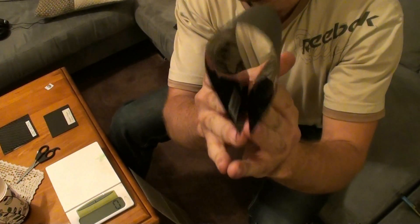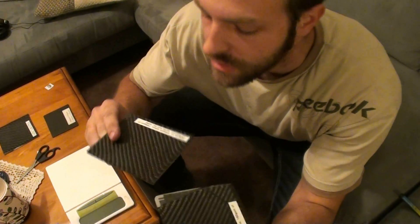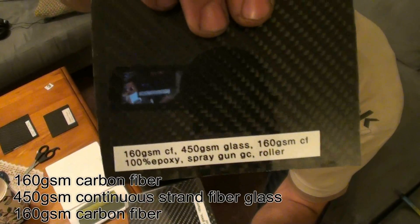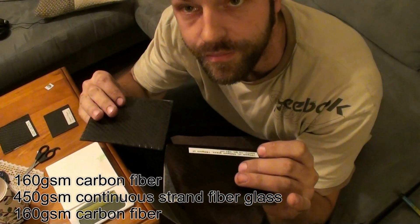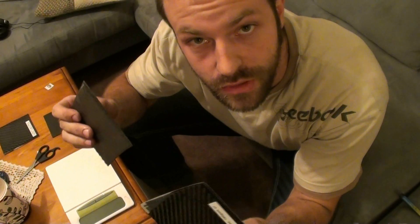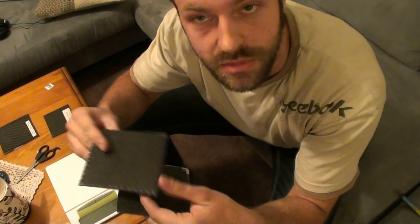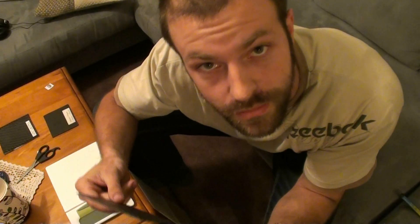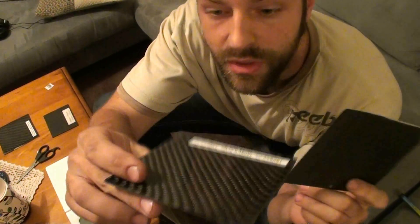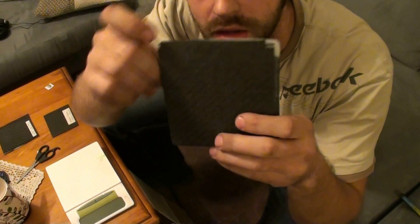You can just go ahead and bend the infused piece right over — no problem. Now both of the next pieces have a 160 gram sheet of carbon on top and bottom, and a 450 gram per square meter fiberglass continuous strand mat. Straight away I can tell you that the one made with a brush and gel coat is at least twice as heavy, even though they are about exactly the same size.